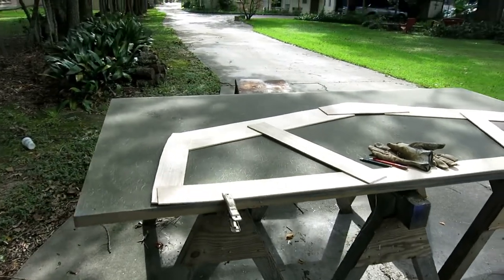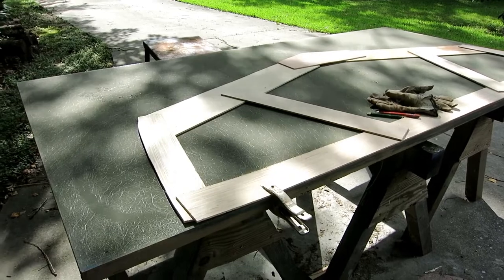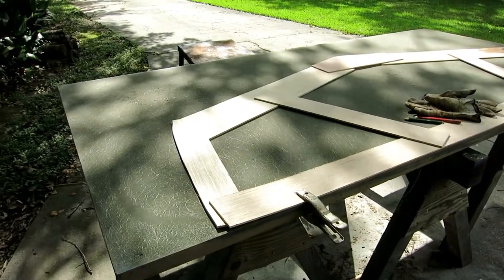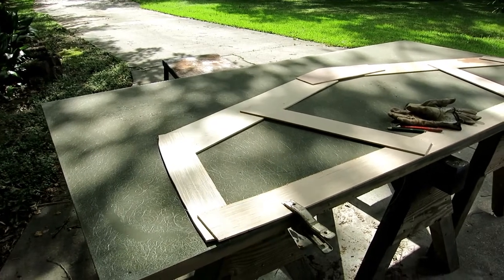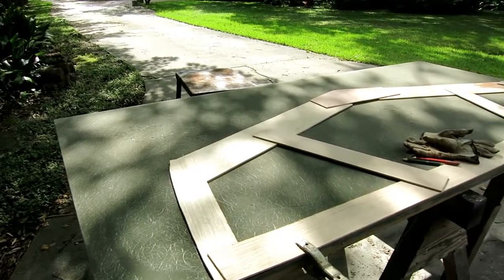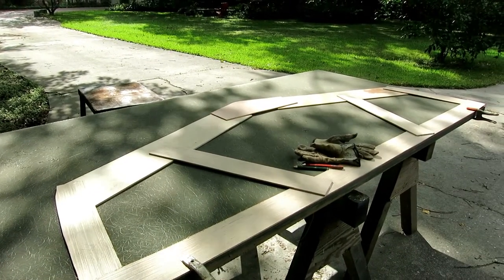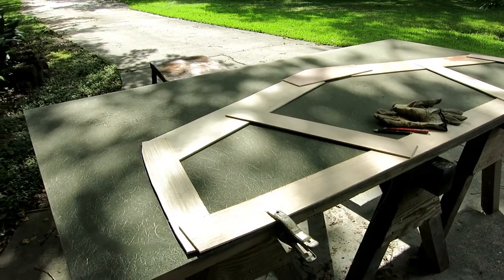So I marked out my Coosa board, and I'm getting ready to cut it. And I don't know, I guess I'll use a jigsaw, because the sides have a little curve to them. I'm really a skill saw man, but I'll try it with a jigsaw. And it looks like I'm going to have enough drop to do the stringers against the transom and to do the frame for the door for the console.